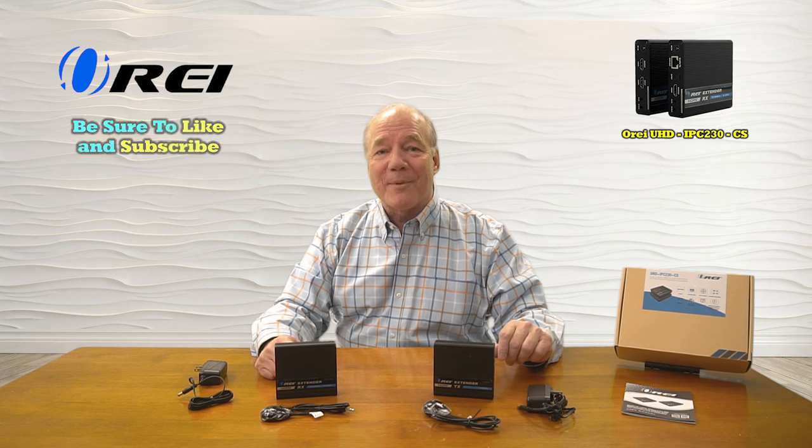I hope you found this overview of the UHD-IPC230-CS HDMI extension kit helpful. It provides a very easy way of sharing all of your HDMI media content with a second remote location up to 70 meters away over a single CAT6, CAT6A, or CAT7 LAN cable. Full 4K ultra high definition support including HDR means you'll get high resolution content at the remote location. Audio extraction capabilities allow you to strip the audio from the media stream and pass it to a soundbar for better quality audio. Local loopback lets you enjoy content at the primary site while transmitting it remotely, the IR blaster kits give you complete control at the remote site, and the cascade capability means you can expand to support more locations. Everything you need to get started is included with the kit, and with a few simple connections you can be up and running in no time.